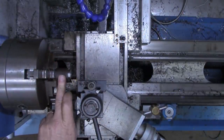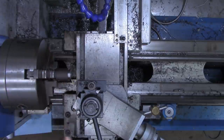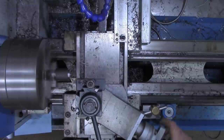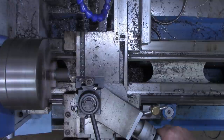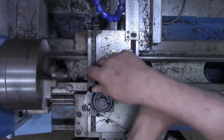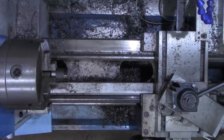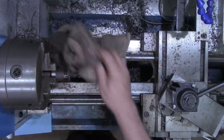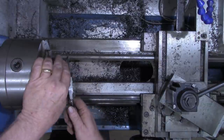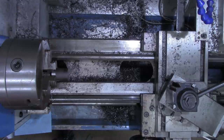Alright, I've got our piece that's going to be the plug for the center of the pulley. Got it mounted in the lathe and we're going to face off this end from a previous project. Alright, we've got it faced off now and I'm just going to take a piece of emery cloth and knock this exterior down. Again as I said it needs to be 1.124 and we're at about 1.132 - a little less than ten thousandths over.